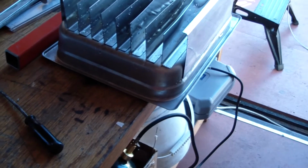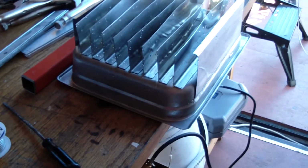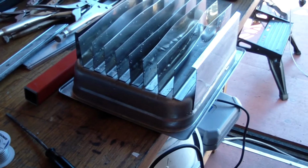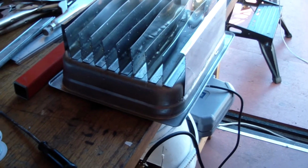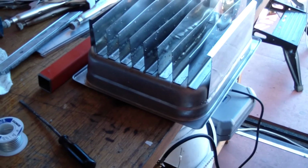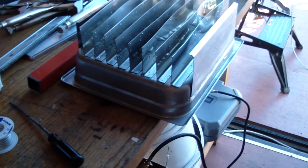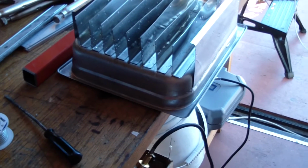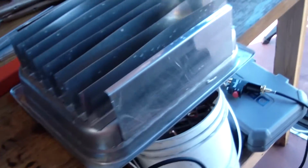But that's something I might consider in the future, is looking into a paste flux, and that way the whole thing gets heated evenly. The hard part about that is just getting the temperature right and the right paste flux, and getting everything clamped, because everything needs to be installed more or less, with the paste flux applied, and that would allow the whole thing to be heated evenly. I'd expect less warping, much better bonds. But this was a good learning experience.